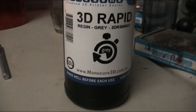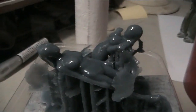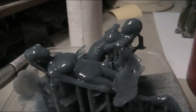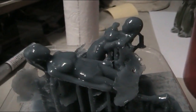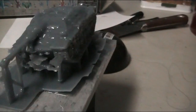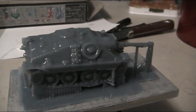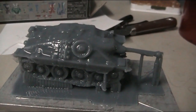Big grey — the most widely used product of them all. Fill up the tank again and go back to the figure test, and while we're at it we may as well film the tank as well. There is a bit of over-cured material — so thin that it's easy to snap off — and a bit more in the actual tank of the 3D printer. But the print in grey is a complete success and will go through a wash. I have a sinking feeling that this resin does not like solid models or projecting a lot of UV, and will do one more attempt with the model being as hollow as humanly possible. Only one layer has stuck up, but besides that and a little bit of over-exposure, it's practically a perfect print. Going to go for thinner walls and more supports at a lower exposure rate.